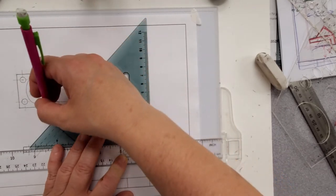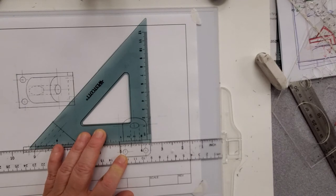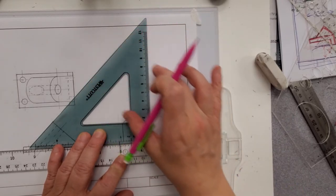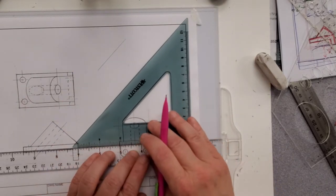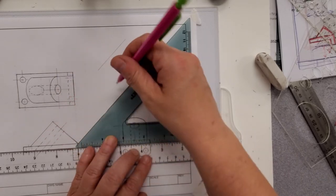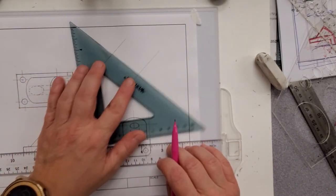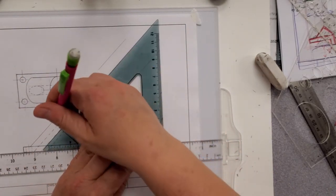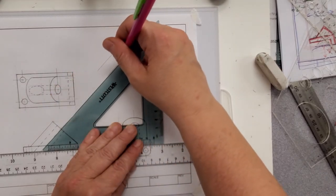And you're trying to draw it out, not in space, like totally far away. I know, it's not too close, not too far away. I know it's real picky, right? But somewhere around here is where you want your auxiliary view to appear. And your auxiliary view is the view that's needed to pull the right dimensions off for that one item, this one face that otherwise you cannot put any dimensions for in any other view.